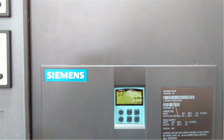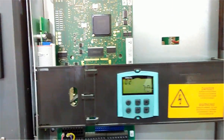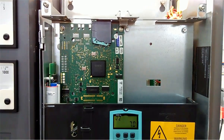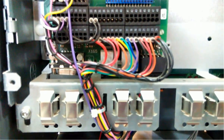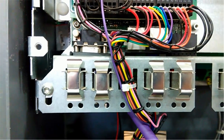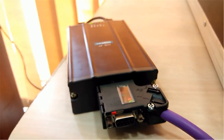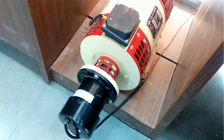Now I will remove this cover and we will see the control unit. Here we have the control card, and on the downside we have digital and analog input modules that we can connect from the field area. Below that is a Profibus port we can use for configuration. This Profibus cable is connected with a communication processor card, which connects Profibus to USB, and that is connected to this CPU. We have this DC motor with a tachometer connected to the DC drive.